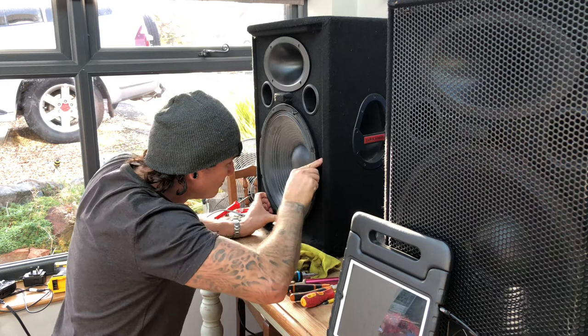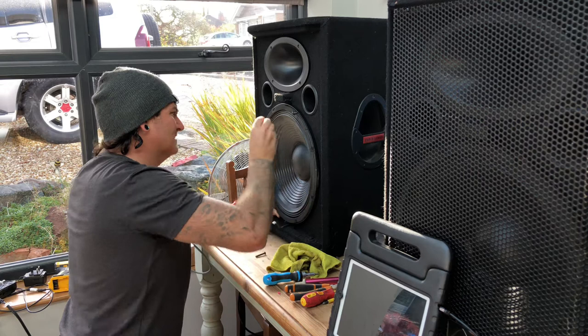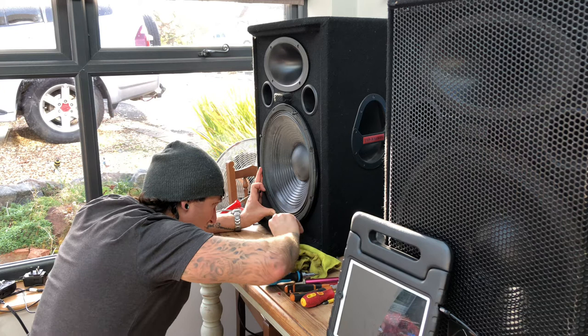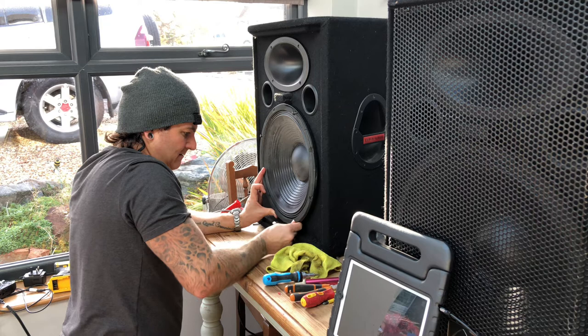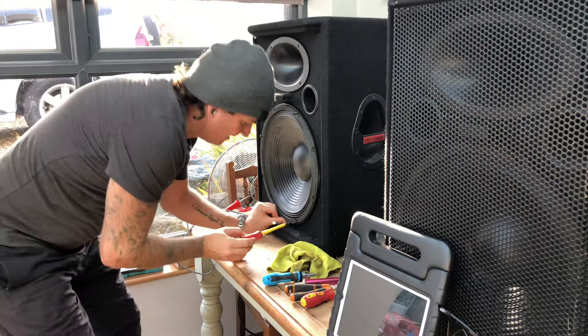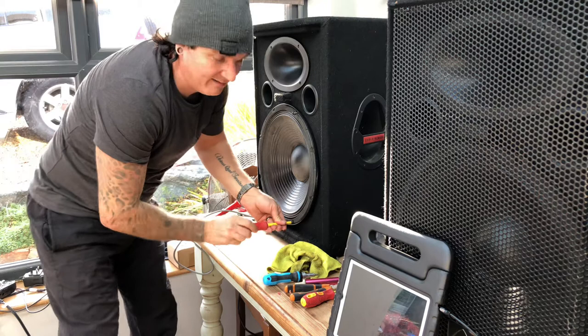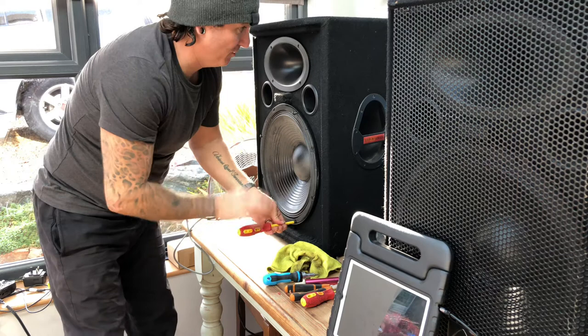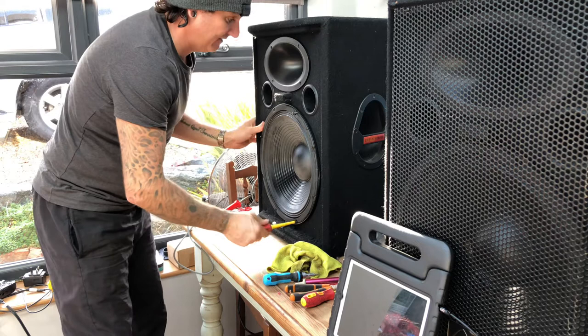And find the witness mark on there. See this? It isn't liking this. That's it. And then we've got them somewhere. There you go. I won't use the impact wrench on this because we don't want to be cross threading and wrecking everything. So I take them out with it, but I don't put them back together with it. Don't get too tight, make sure the speaker's actually going back flush, just like the tweeter casing, which it is. Feel it all the way around, it's flat everywhere now. You want a bit of movement, because we've still got to get the rest in yet.